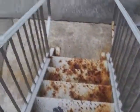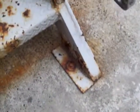At the bottom, I want the feet tarred. Once they're repaired, cleaned, and secured, I want tar on the feet — make it so that nobody steps on the tar, be very neat about it. I would tar four to six inches above grade so that the snow doesn't eat those. Put some tape down, tar it, about six inches above grade so as the snow accumulates it won't eat the bottom of these things.